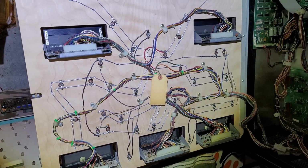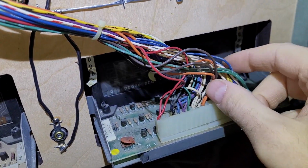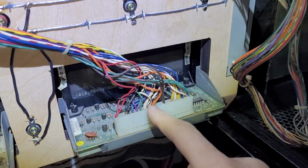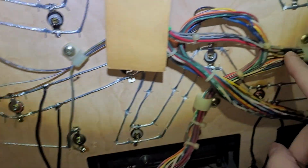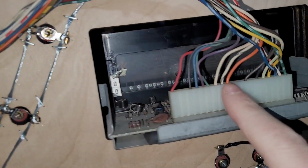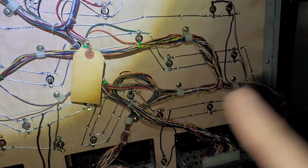All right, upon closer examination here, I'm starting to think that the wiring might go from here to player 4 display first, because these are all double wires. For example, the white-black wire is the 6th digit. So perhaps it comes in here and then comes back out, and then goes to player 3, which is now just single wires because I did my thing. And then it comes back around, goes in and out of player 2, and then finishes at player 1 because these are all singles. So I'm thinking that instead of going 1, 2, 3, 4, I'm going to go 4, 3, 2, 1.